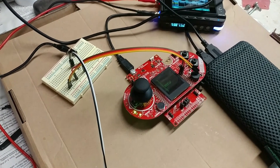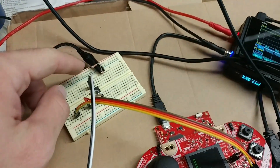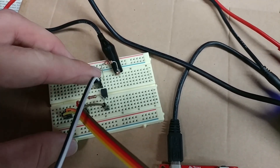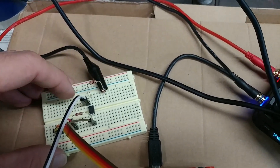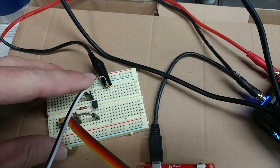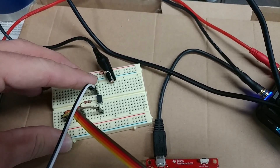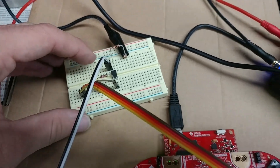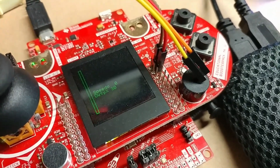Here's the setup indoors. This is what drives the pump. We have 12 volts going in through this white wire, which goes to the positive side of the output of the optocoupler. This lead here for the resistor is the signal, and this other one is ground for the 12 volts. The optocoupler switches on and off. This resistor keeps it at 0 volts when it's off, and when the optocoupler comes on, this lead goes up to 12 volts. And this is a current limiting resistor for the LED side of the optocoupler, wired up to an I/O pin and ground as a normal LED would to the microcontroller.